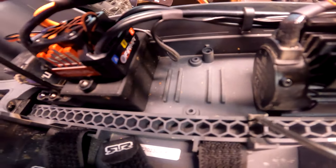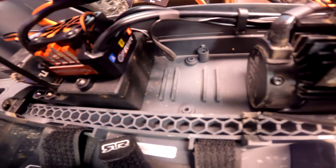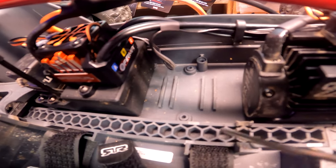You can see right there it's eaten up. Look where the bearing ends - it's too close to the motor. You just have to move it over just a little bit, because it looks like what they had to do is cut this piece off to fit the motor, so this allows the bearing to walk.